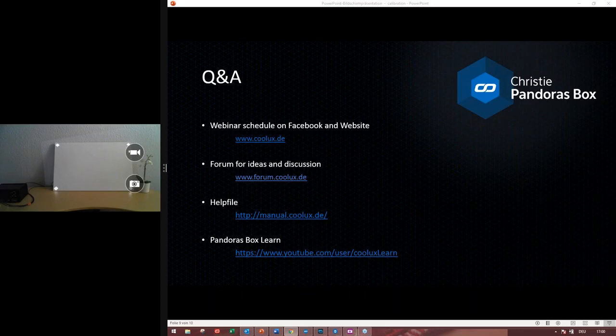Thank you, Thomas. I have to add one more thing. If you want to use the projector recalibration with a calibration link, then you have to make sure that you're using Widget Designer version 6 or upper, version 6.1.0 or 6.1.1, and Pandoras Box version 6.1.3 or higher. And you have to make sure that you have the .NET version 4.8 or higher. So that's it. Great. Thank you.